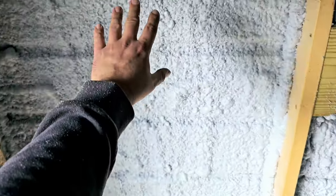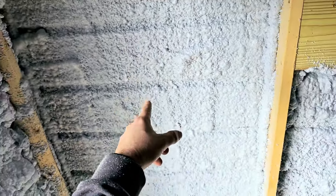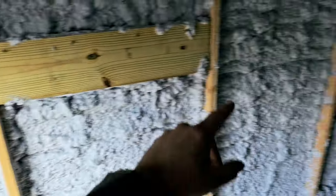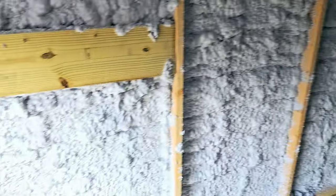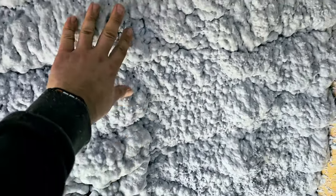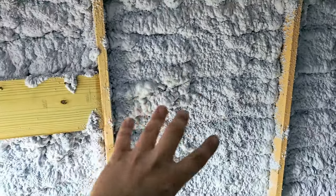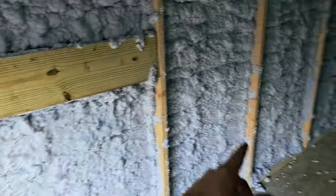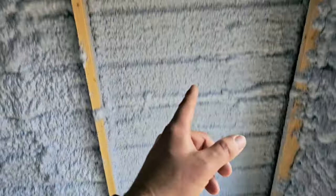You can see the difference between this section I just finished spraying and this other area over here. This is much smoother — that's what happens when you use the right tip. That's what happens when you use the wrong tip. Once it hardens up, it's like a closed cell foam. If you know the difference: open cell is kind of squishy, and closed cell is much harder and firmer — that's why the R-value per inch is over five. Look how smooth that is versus how lumpy that is. Make sure you watch the video on their website — the link is in the description.